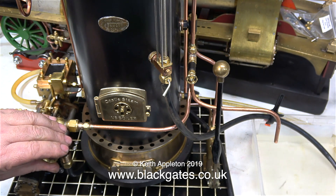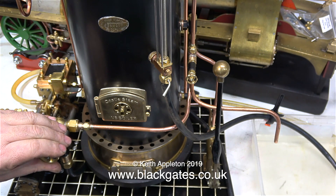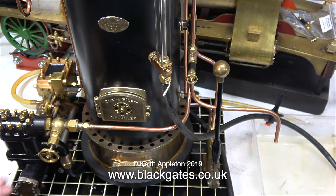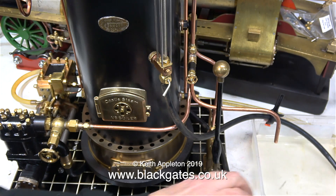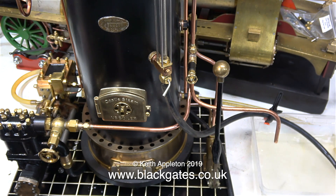If I didn't do this it would be the shortest air test in the world. The Southworth pump moves a lot of water — possibly about 20 or 30 strokes of the pump would fill the boiler right to the top. With the boiler pump running slowly and the blowdown valve open, the water goes into the boiler and runs down the pipe back to the tank via the blowdown valve.